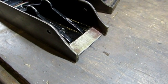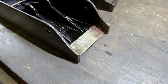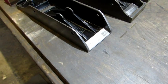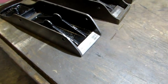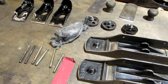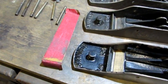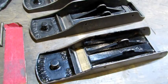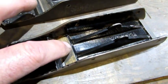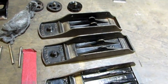Next thing I'm going to do is take this broken end right here and shape it up so it's more like a chisel plane instead of this mess that it is right now. So I reshape the end so it can work like a chisel plane. I use some 3-aught steel wool and my sanding stick — this is just a piece of wood with some 150 grit glued to it. That stick was used to clean up the machine surfaces, these flat places right here, and then steel wool over all of the Japanning.